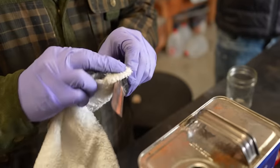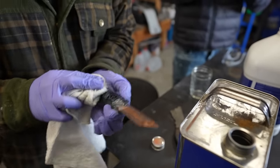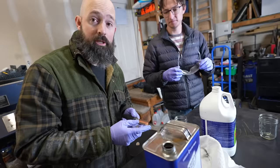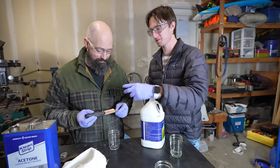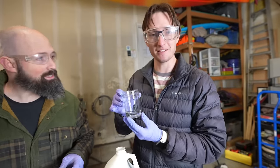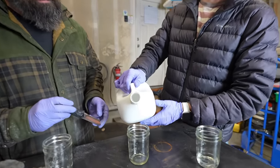Before we etch this, I'm going to get it super clean. If the surface is not touching the acid, nothing's going to work. Acetone's perfect — it's not going to destroy anything on here. It won't hurt the epoxy resin, it won't hurt the scales, and it won't hurt the metal. We have muriatic acid here — it's for etching concrete, but also works well to dissolve copper more so than the titanium niobium. We're going to put this into the jar and add a little special something: industrial grade hydrogen peroxide, about 10 times stronger than the stuff you get at the grocery store.